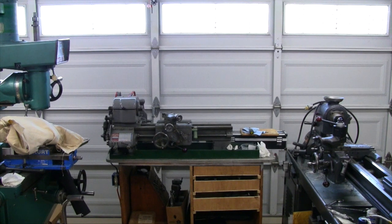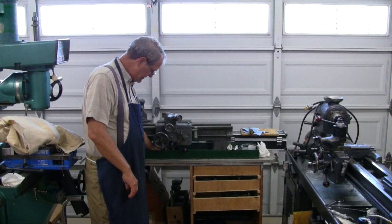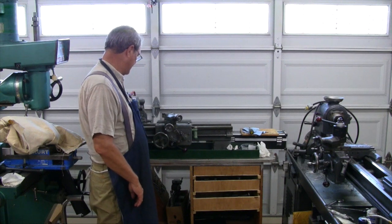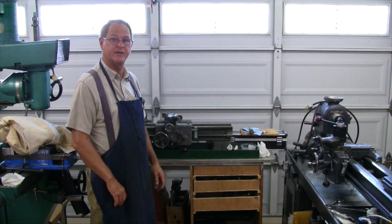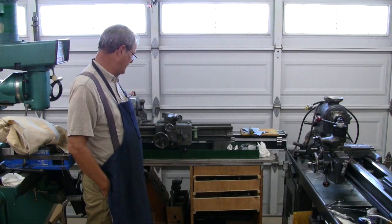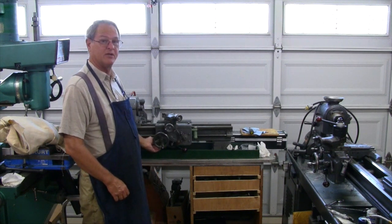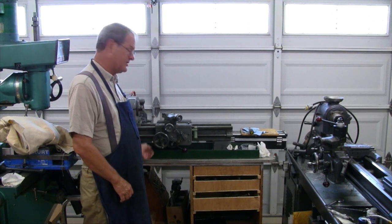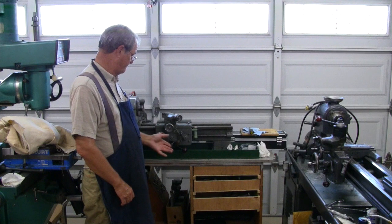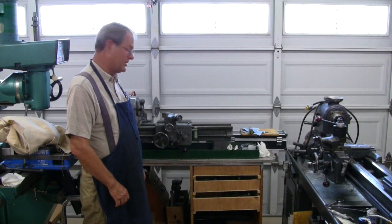One of the things that's always bothered me about this lathe is that right down here there's a plug that drains the oil well for the automatic apron, for the power feed mechanism. While I'm getting this ready, I thought I would go ahead and pull that out and see if we can seal it up like we did on the 11-inch lathe so that it doesn't leak anymore. While we have it off the machine we'll take a look at the insides and peek behind the apron. Hopefully this will be of use to other people who have a similar apron - we're trying to add to the body of knowledge on these Logan lathes.